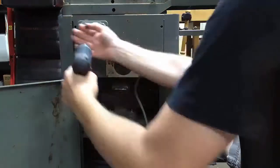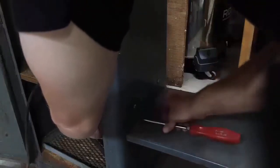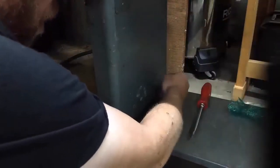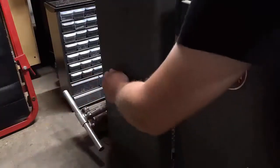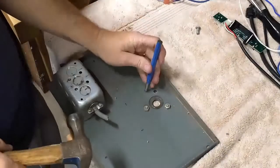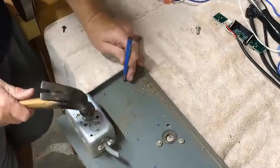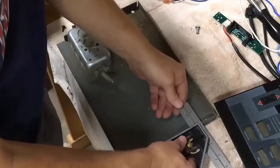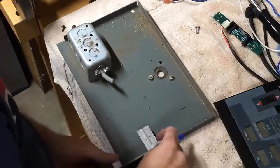We've got to get to installing this. I actually saved what this motor is mounted to — that portion of the treadmill. I'm going to cut that down and modify it to fit inside the lathe and lift it up a little bit higher than where my AC motor was, and I'm going to use the rest of that area down there for storage, which will be cool. So I started off by taking off the front panel and also removing the old motor, which kept seizing up. Then I took out the bottom shelf and I'm going to use that to mount my new DC motor on. I'm laying out where all the electronics are going to go — the controller and where my potentiometer is going to be coming through, so I can mount the switch through the actual front panel.